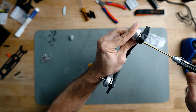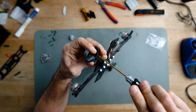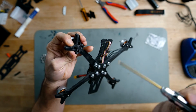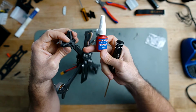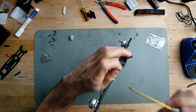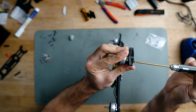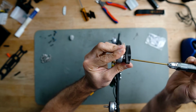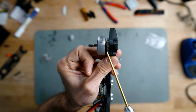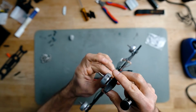So pay attention to that. The screws that we include in the package normally have Loctite pre-applied, which is good because, as I said before, you shouldn't have fresh Loctite on a plastic part. It would eat it. But it's good to have pre-applied Loctite because the motors will have vibrations and you don't want the screws to just fall apart. You see here that I go all the way in, but there is no screw coming out or touching the wires of the motors.